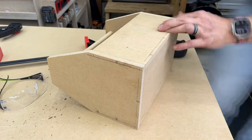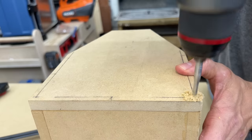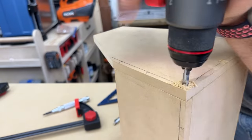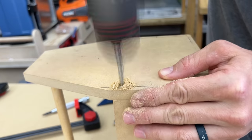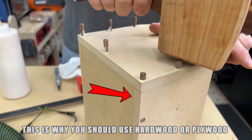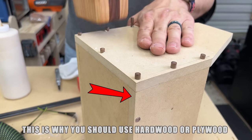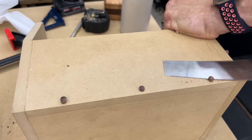I'm going to use the walnut Miller dowels here at 1-5/8 by quarter inch — that's going to make a really nice contrast when we put our finish on there. From there, I'm just going to center punch everywhere I want a dowel. I've laid all these out, spaced them out equally around the edge of this tool slash drink caddy, and then you just start drilling the holes and inserting the dowels. I made this out of MDF, but I would actually encourage you to make it out of hardwood or some other material — plywood even works too.